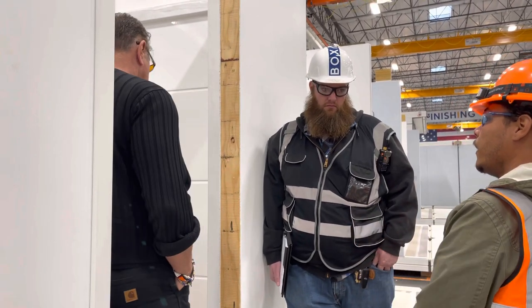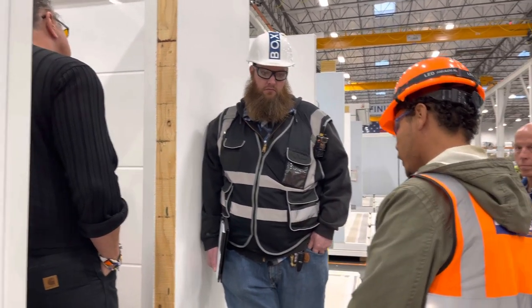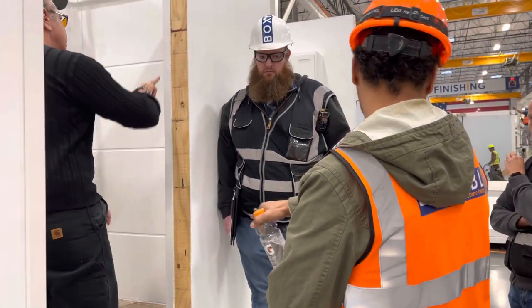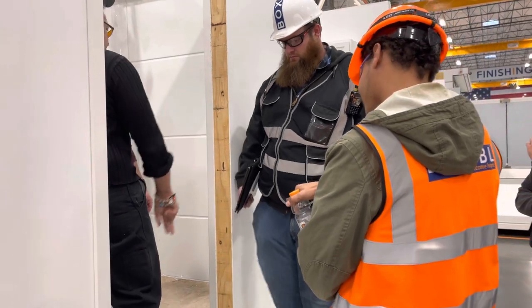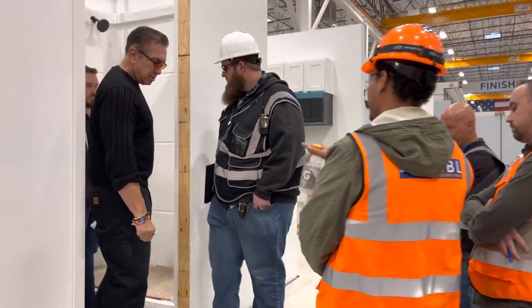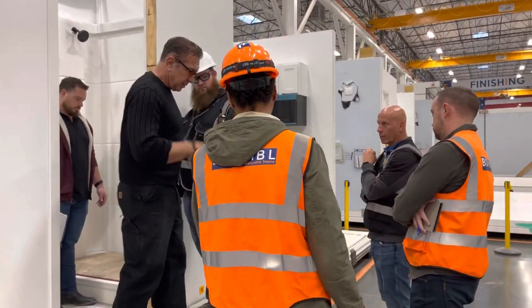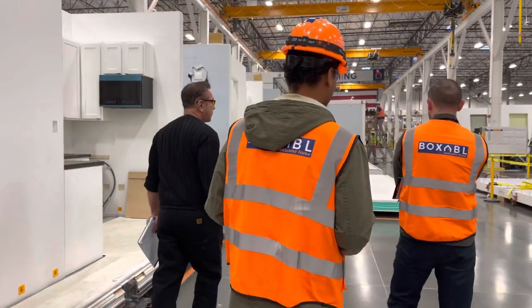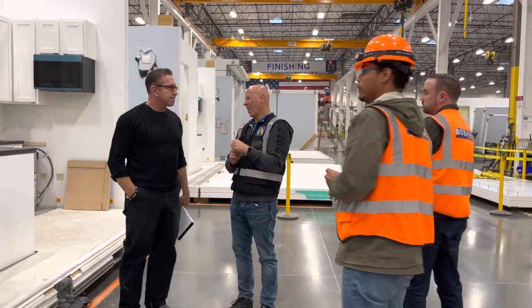should eliminate the cracking. The other issue that was causing a lot of rework on showers was the silicone cracking on the bottom. We've eliminated the silicone, so that's no longer reworking showers. And then the other one was a lack of support for the shower fan, which we've addressed. So we've engineered out a lot of the rework issues. We still have the quality of cracking.